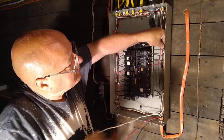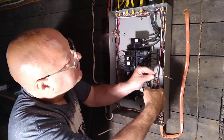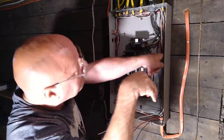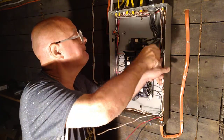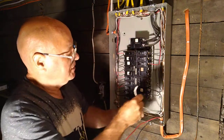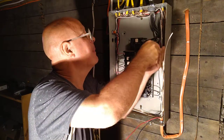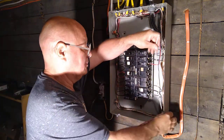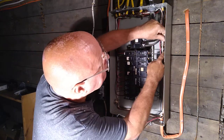I'll bring it up and put my pliers on the area where I'm going to make my bend — make my bend right there — and I'll cut it right here. I'll make sure it's through all the way. Next we'll get our white wire going into this terminal up here. I'll loosen this one up, bend it down into the corner of the box, and bend it right here.